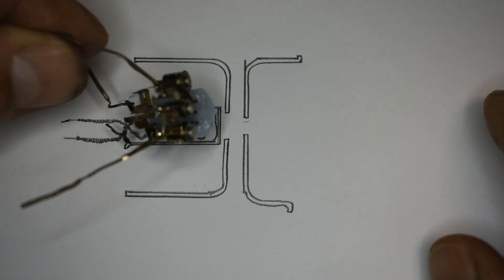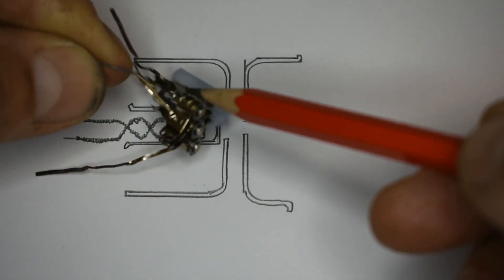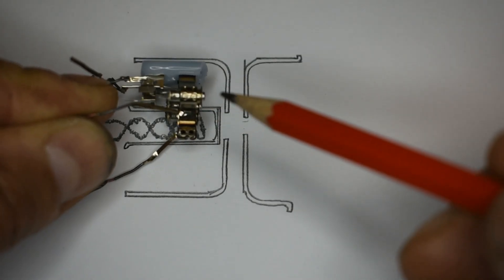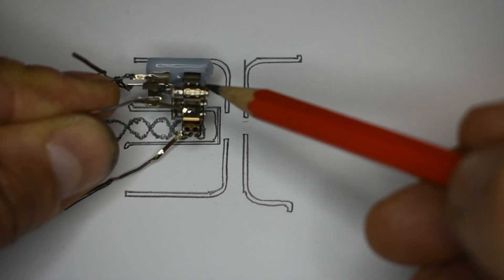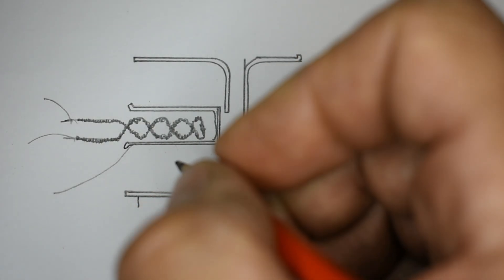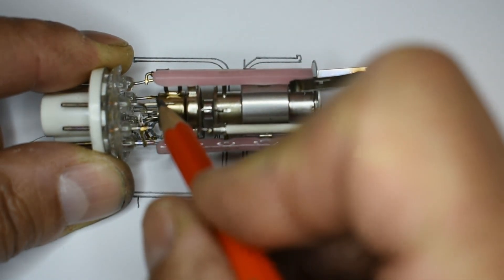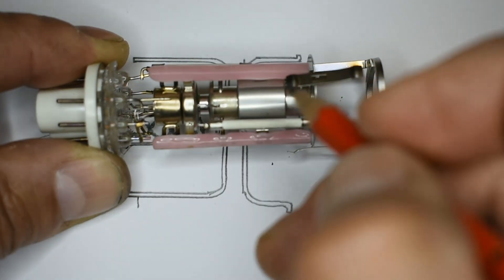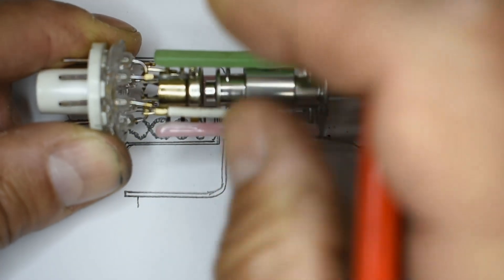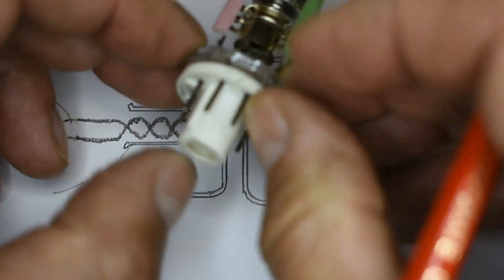In later guns the cathode assembly is built into a protective tube which is at cathode potential, with the heaters appearing at the bottom. You've still got to identify the two heaters — the cathode is the first cylinder, which is in here. This is your grid, and you can see the connection coming out to the pin here. The first anode similarly will have a connection coming out to a pin. The monochrome tube monitors are quite good — I'll put a list of what the pins are, as they tend to always be the same. It's the later colour ones that are a little more tricky.